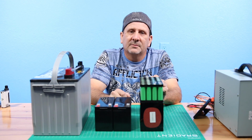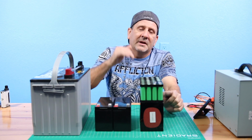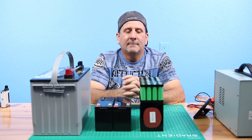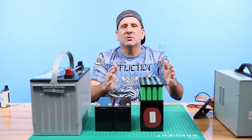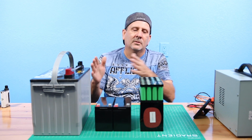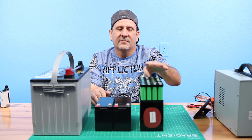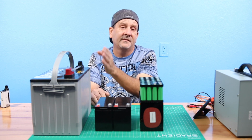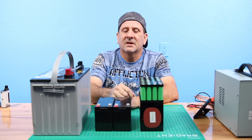In my 24-volt systems, I'll be doing the same thing. In my 48-volt systems, I'll be doing the same thing. I will be running higher voltage, more power. Everything runs better that way, and you'll get more power cycle through the range. So you'll be running higher voltage, and therefore you'll have a longer life cycle, because I'll be adding a cell to it. So instead of a 3S system, we'll have a 4S system. Instead of a 13S or 14S, we'll have a 14S or a 15S or even a 16S pack, as we get up into the 48-volt stuff and the 24-volt stuff.